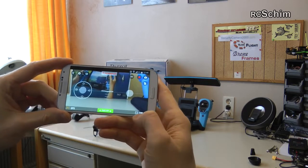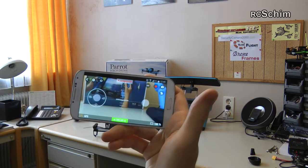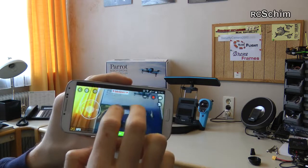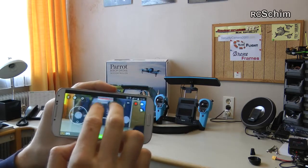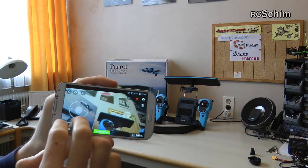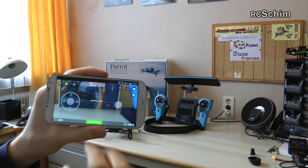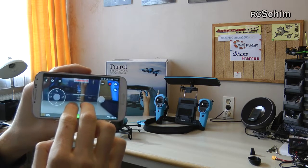Over here you have the GPS status — this is the symbol for the drone; in the room we have no GPS. If you use two fingers you can tilt and pan the camera to a certain degree. This is because you have the fisheye and it can move within this large 14 megapixel picture area. You can move quite far up, move to the sides, and of course if you are on the edge of the fisheye it gets distorted and a bit unsharp, so it's better to stay in the center. Maybe you can look down because the whole fisheye is tilted down a bit — it's a nice option.